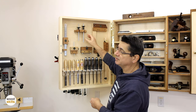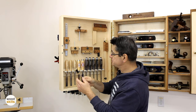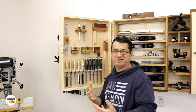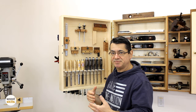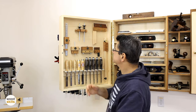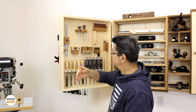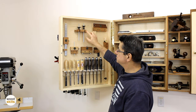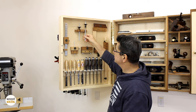The reason I have two marking gauges is that when working with half-blind dovetails, you have to readjust the marking gauge each time for either transferring the pins or working with tails — you lose precision doing that. So they're preset for offsets from the half-blind to the edge of the board. These are custom tools; this particular cherry tool took me a little longer than the others to make. Moving along, this is a wood square — also one of my own tools that I designed and made.